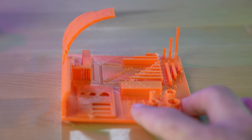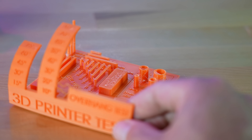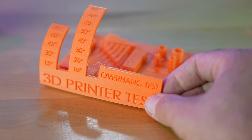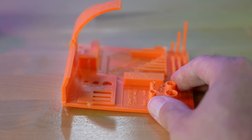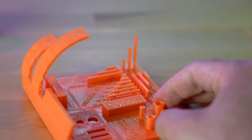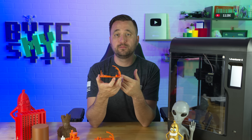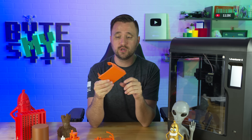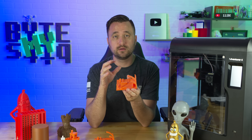On to some benchmark testing — this is where I noticed some issues after printing on the bed for a while. The pads that come with the packaging are really good for the first dozen or so prints, but after that you notice warping and things not sticking as well; you start using glue sticks. I printed this without any raft and it worked. I used orange Hatchbox filament which is actually pretty terrible — I had a green from them that was so bad I threw it away. The orange is good for strength, but print quality is more of a settings thing I need to nail down.